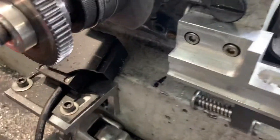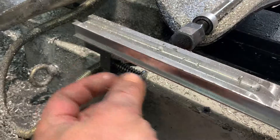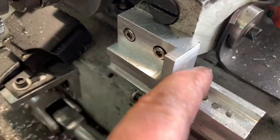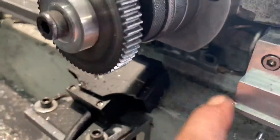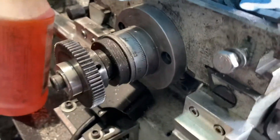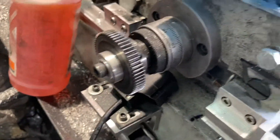For this side I took some 6061 aluminum and machined it — it's actually grooved so I can just loosen that up and it slides in there. There's a groove just like you'd normally have in the front T-slot. I didn't really need a T-slot here so I just put a few adjustment bolts in there. There's no adjustment needed between here on the Y-axis — the main thing is I just don't want it crashing, so I want it to stop before it keeps trying to drive through.